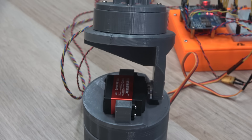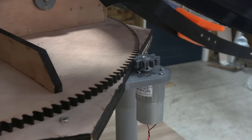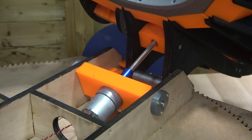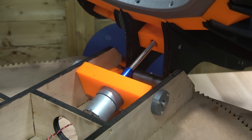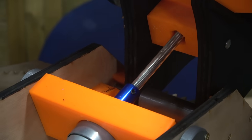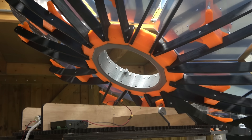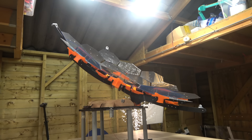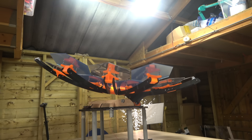The mirror's movement is driven by two electric motors, but this is where I think I might have really messed up. I'm not too worried about the left-to-right rotation since that axis is supported by the large Lazy Susan bearing, but my concern is the placement of the spindle drive that tilts the mirror — it's mounted close to the pivot point, so the weight of the mirror will act as a lever, and not in a good way. There's only one way to find out. It actually works far better than expected, and after running it a few more times it's confirmed: this works perfectly.